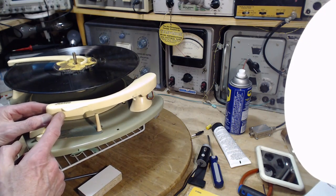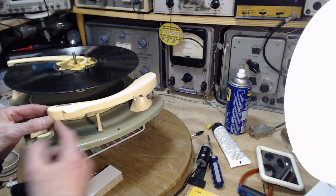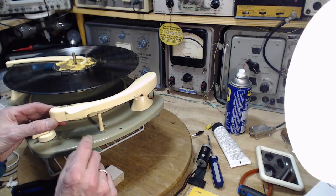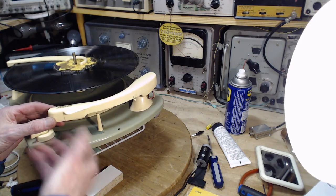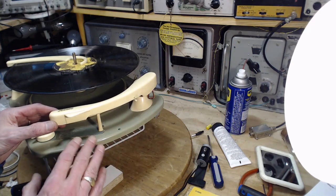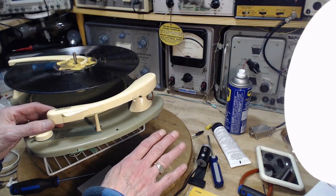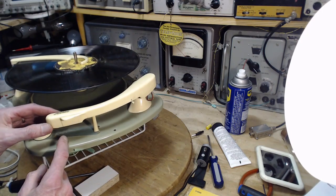So you don't need much of an amplifier to get all the way to having the speaker operate. But the newer ones with the balanced tone arm and the light, fragile cartridge produce very, very low voltages. Those need to be amplified a lot. So that's where this concept of the preamp showed up. You could use your old crystal amplifier, stick a preamp in, stick in a different kind of cartridge, but not in this. Not in this.